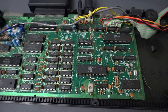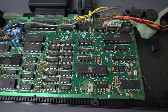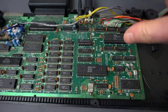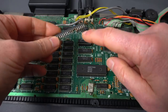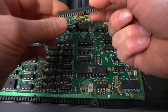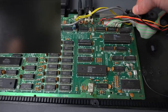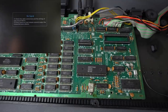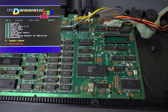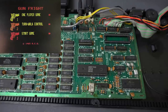It seems like a stretch, but this is a really bizarre and interesting failure state - so I'm glad I'm making a video about this. I suspect what we're seeing right now is completely independent of what we've done so far. It looked like things were working before and then we're getting that red screen, and that was mostly because the floppy disk controller probably wasn't working at all. So will it run a game? We don't even get the menu for the Dandonator. But if I remove the FDC, do we get the menu? We do - and it works fine. Let's try Gunfright. Yeah.